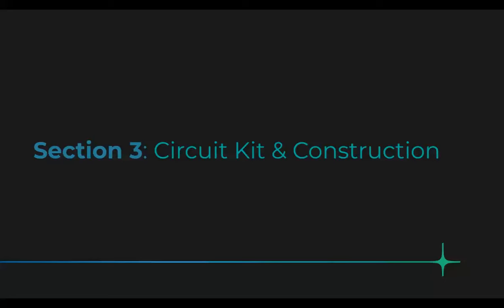For most of the stuff that you're going to be doing, for small low voltage, low current applications, or any voltage but low current applications, you're going to be using the middle one, VΩmA. It's going to allow you to use almost all the functions of the multimeter. The 10 amps is for the 10 amp fuse that's in here. That's for high current up to 10 amps. Do not measure any current over 250 milliamps with the middle one, or else you will pop the fuse and we will all be sad.